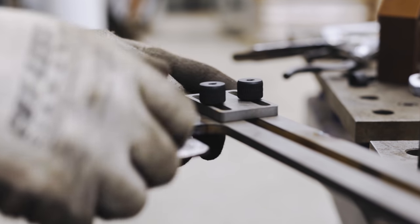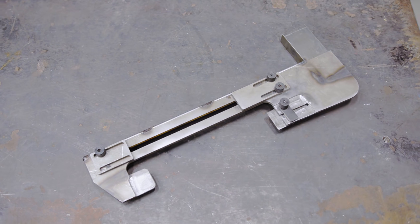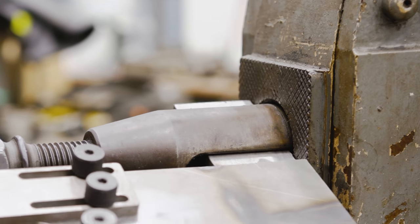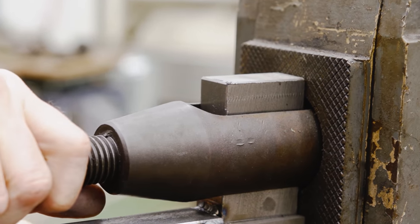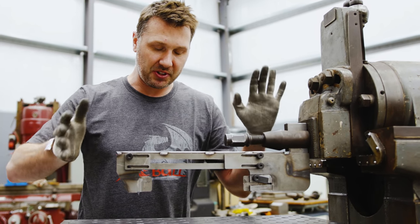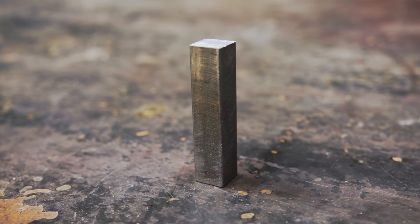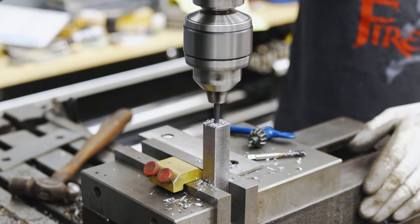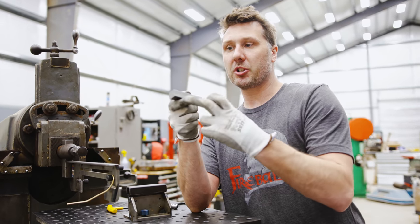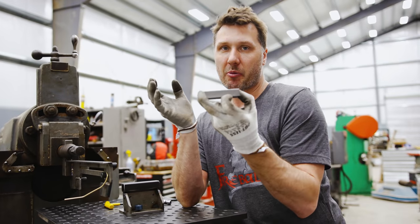And then I added some bump tabs — these are fully adjustable, and I'll be talking about those a little bit later. This is the file holder that's going to be doing the majority of the work, and it just slips into this tool post holder just like a normal tool would on the shaper. Tighten this up and then we'll indicate it in to make sure we're nice and square and perpendicular. I'm going to use these coupons — a piece of hot rolled steel, 3/4 by 3/4 inch or 19mm by 19mm, with a threaded hole in the back, and they're all going to be the same. We'll measure the length before and after, and take the difference. That way we have something to gauge from.